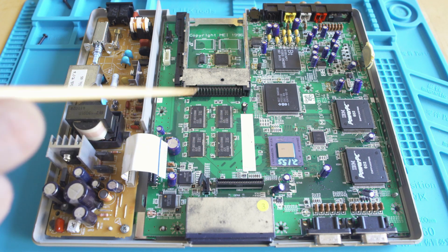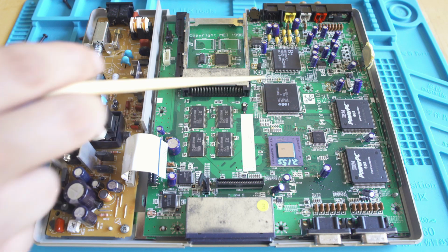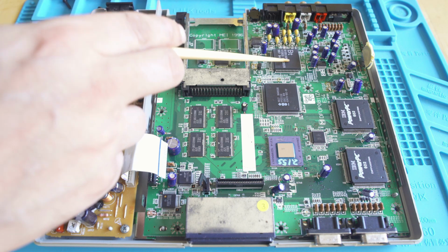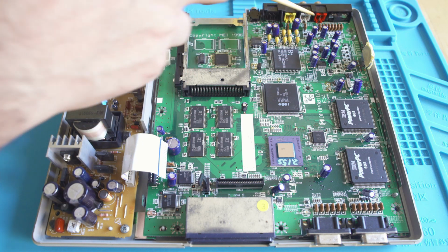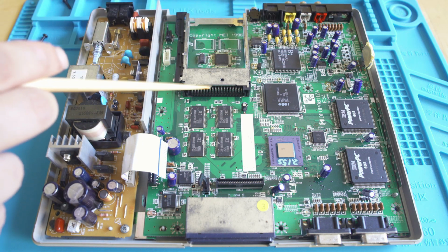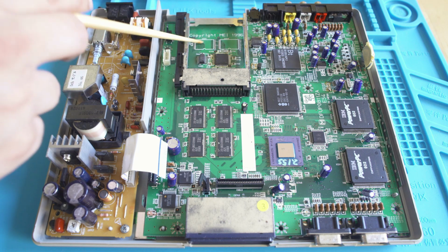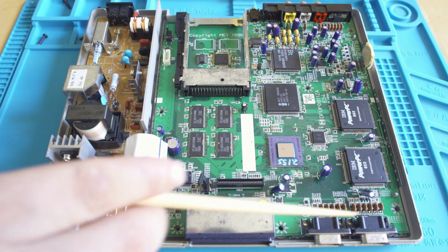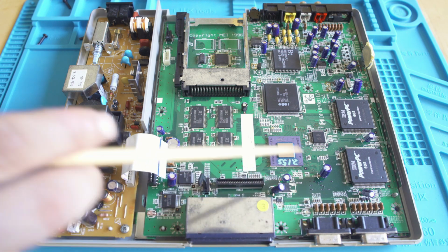We got our RAM chips right here, 8 megabytes, and then we have all the other chips that comprise a 3DO. The PowerPC 602 processors, the 3DO bus chip, and the Bulldog ASIC. Back there is just that PCMCIA slot again, and you're going to notice there's 2 chips that are not on the board, and that is going to become really important in just a second, because this does not function.